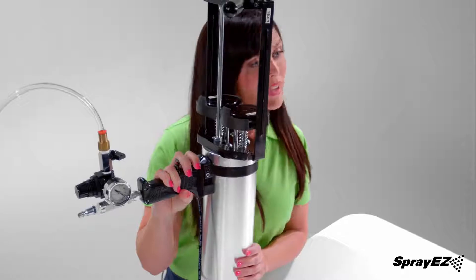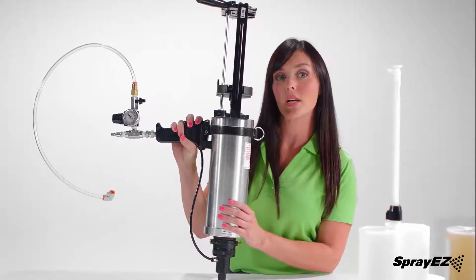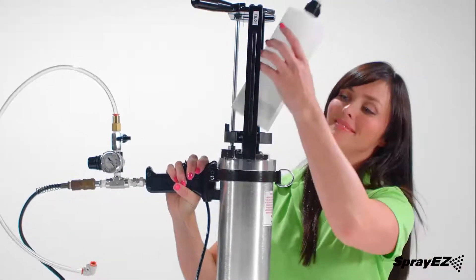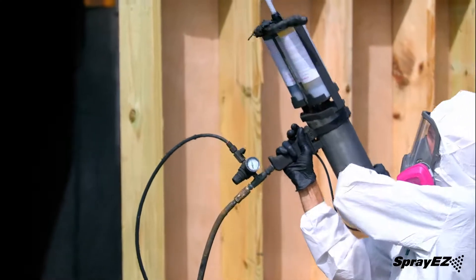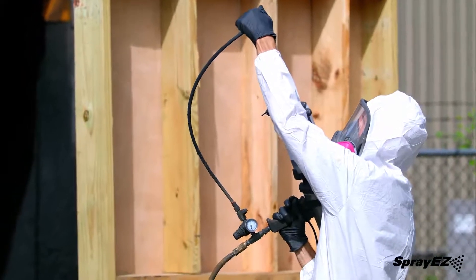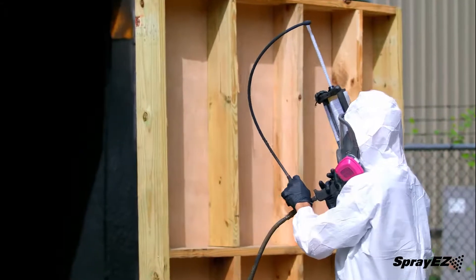Notice the flange — it attaches to the cartridge by holding it firmly and flat against the spout and slowly screwing the black knob onto the mixer to the cartridge. Holding the gun on a steady surface pointed up, place the cartridge in the gun with the static mixer never facing down, as gravity will cause the foam to pour into the mixer and react. Make sure your button is in reverse, pull the trigger, place your cartridge into the positive displacement rod, and place the elbow bracket onto the static mixer until it clicks. Always keep the gun in an upright position — if you tilt it, materials can go up into the static mixer prematurely.